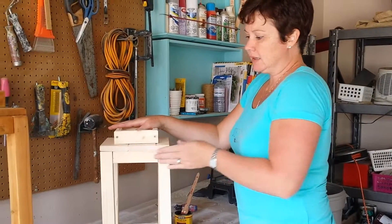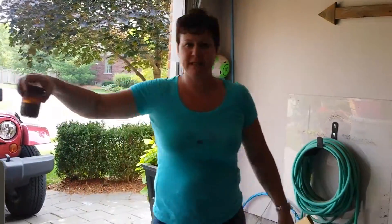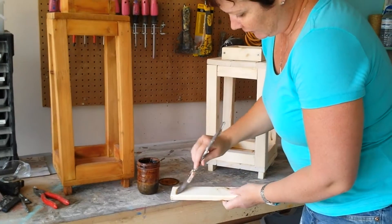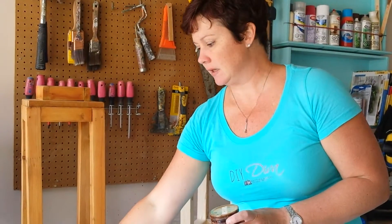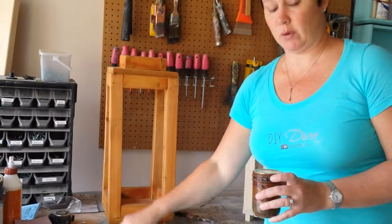The next part is adding a coat of stain. The cheapest and easiest stain you can do is called oxidizing the wood. To do that, you mix a piece of steel wool and vinegar in a jar — you have to let it sit for about three days. When you touch the wood with it, the wood is going to change color in just a minute — what it's doing is aging the wood for you. I like the restoration hardware look. I did it on this one and then sanded it off; for me it's a little too orange. There is another way where you rub a wet tea bag all over it to bring out tannins in the wood, and then when you put this mixture on it will go a bit more gray.